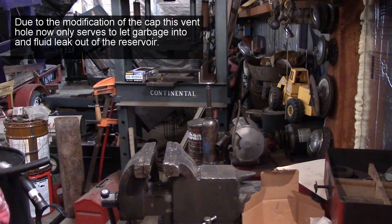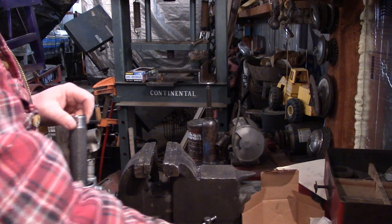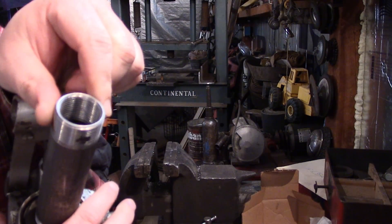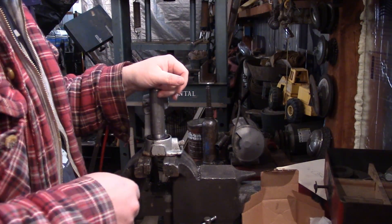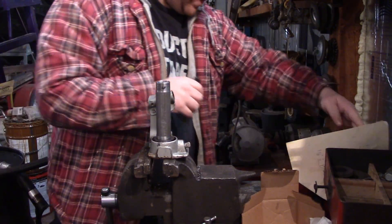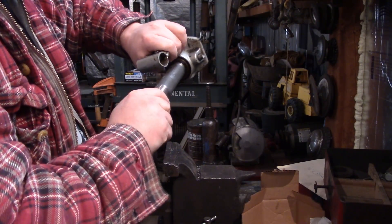I'm going to show you some of what I JB welded. This is just a vent hole on this particular piece. Another area I JB welded was a little pinhole on this thread here — I noticed it didn't seem like anything I was going to put through there was going to plug that back up. I'll just chase it with a tap real quick because JB weld did seep through to the other side. Three-quarter inch pipe tap. It should thread through that JB weld no problem.